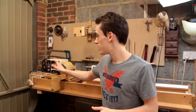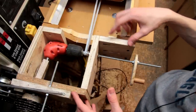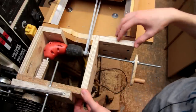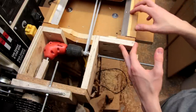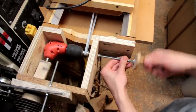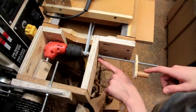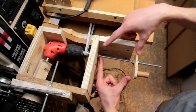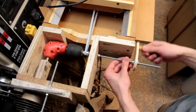So I think we'll start over this end of the setup where we've got the handle. Everything up this end is attached to this little makeshift plywood box which I put together, and that screws directly onto my original lathe duplicator. The little handle here provides movement to the entire rig. It's a little bit further away from the bearing it's mounted on than I would like, but I needed it to protrude far enough past this point here for me to crank it.